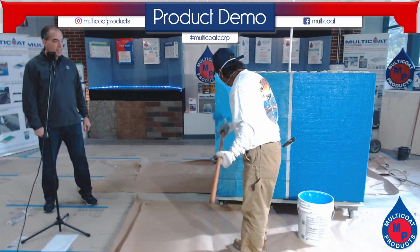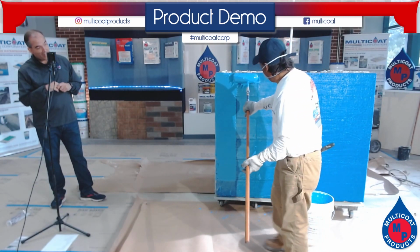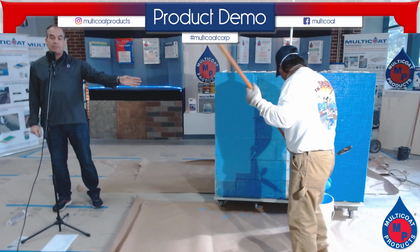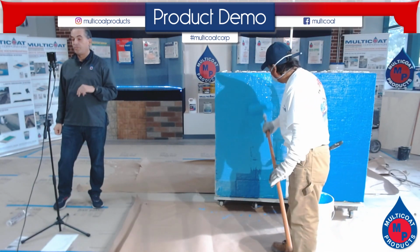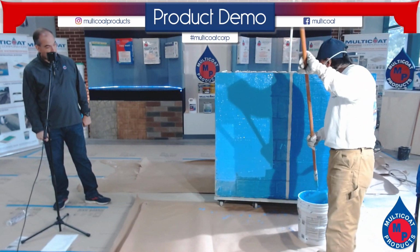And when you're putting this on, when you're rolling it on, with a 3/4 nap roller, same as the BG, we want you to put it on, it's not like painting the wall. We want you to put it on thick. Typically, for this kind of application, you'll get 250 square feet per bucket on the Multicoat for 2 coats. The BG, you'll get 200 square feet per bucket because it's a thicker product for 2 coats.